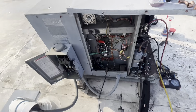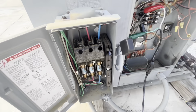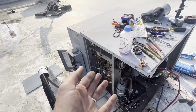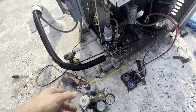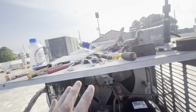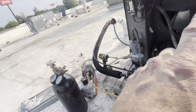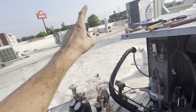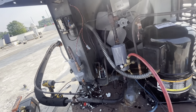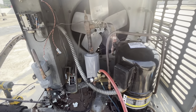I've got the power but this disconnect doesn't give me anywhere to connect, so I actually had to connect in there - which is fine because I've got 208 and I switched that to 208. So we're rocking. While this is running I'm going to go ahead and start cleaning up my trash, taking my torches down, taking my nitro down, getting everything headed towards getting out of here. The high limit switch was dead.